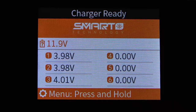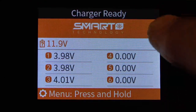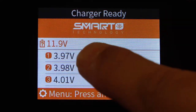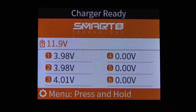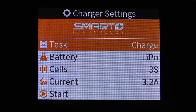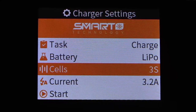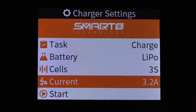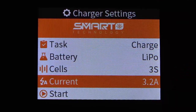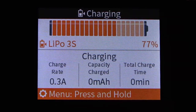With a standard battery plugged in — I effectively call these dumb batteries since they're not smart batteries — the charger ready screen shows the pack voltage and individual cell voltages. To start a charge, discharge, or storage cycle we press and hold to access the main menu. This battery is a 3S LiPo, which is correct, and it's a 3200mAh pack, so we've set the charge current to 3.2 amps. We go down to Start and click the center button to commence the charge cycle.